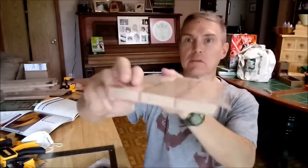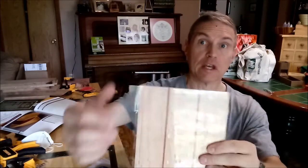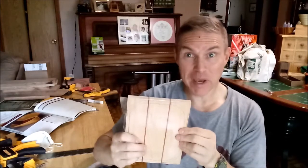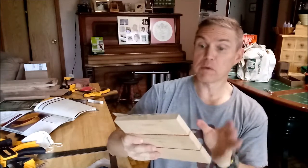The overall finished product length is going to be seven inches long versus six inches wide. I went ahead and those are the outside line dimensions. Then one quarter inch in from that I put in the first ring that I'm going to have to cut out. I left it slightly bigger, maybe a sixteenth of an inch bigger on this end — that's where I'm going to drill my starter hole. I've covered this with packing tape to lubricate the scroll saw blade, and since it's going through thinner material hopefully we won't have the same burning as last time.